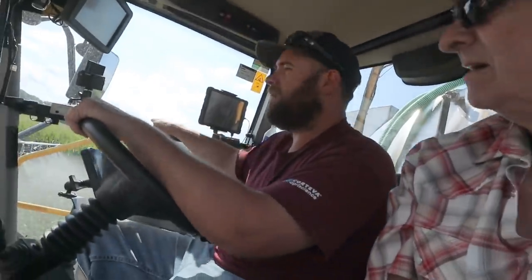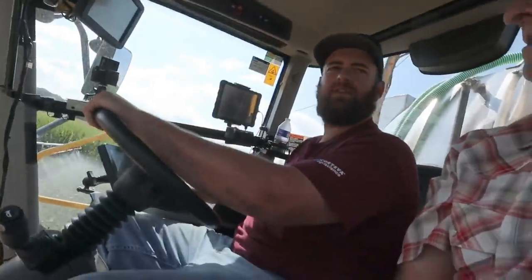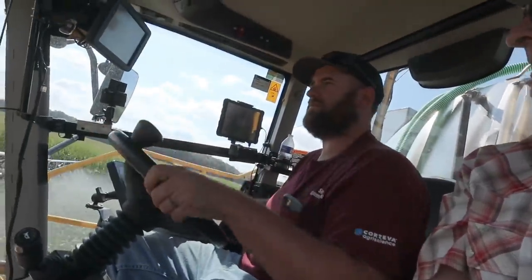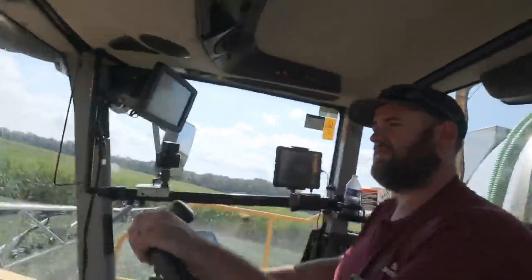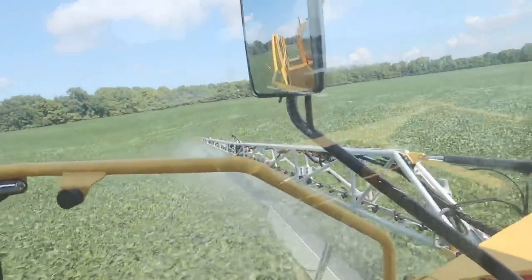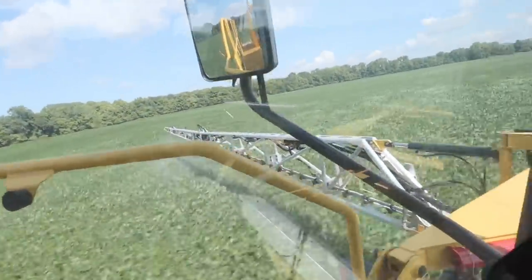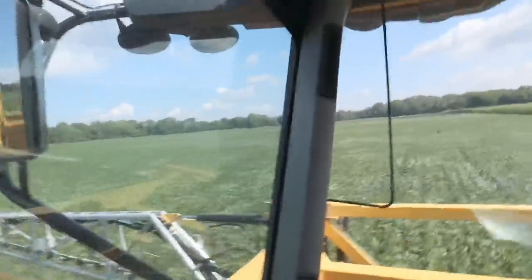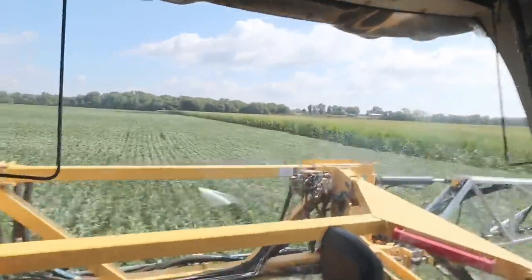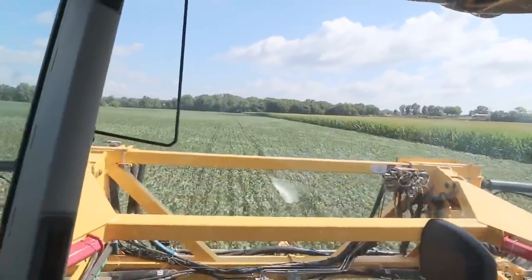Why does it look like that one nozzle is shooting off the side, almost like it's hitting that boom and maybe deflecting it? It is. One of them is that back one. It's offset. Take it easy right there. There's a low spot right here. Got to let your boom work. You got the auto. Keep going. Don't slow down that much. Just slow down a couple miles an hour. Got the auto boom on. Got to let it work. They're running like 15 miles an hour.